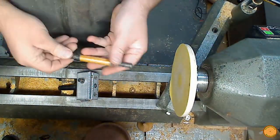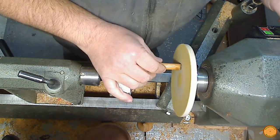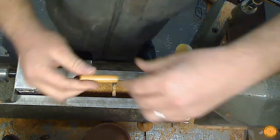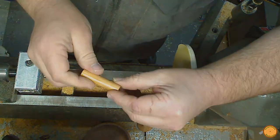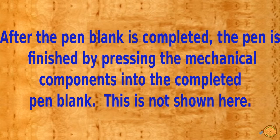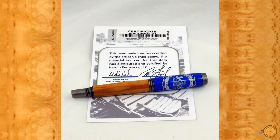The excess CA on the end of the blanks is carefully sanded off using the same sanding setup as was used for squaring the blank. There is one finished pen blank. After finishing, the pen is completed by pressing the pen components into the completed blanks. Here we see the completed pen. This style is a Junior George rollerball with a body made from wood reclaimed from bleachers at Penn State's Beaver Stadium.